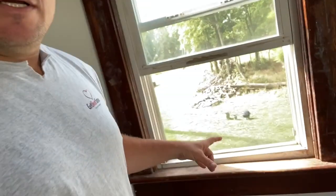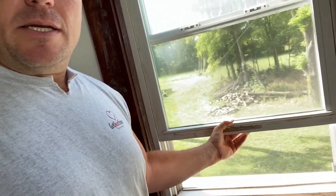On the bathroom, I used just a typical box fan and it was fine, but it doesn't fit in the window very well. I've got a fan from an old bounce house that I think my sister used to have. She gave it to us, but we never really used it. I still have the fan and it's pretty awesome. So I'm gonna make a little negative pressure air machine with a filter that I can put in this window, close this, and we can pull a negative on this room and help control the dust. So check this out.